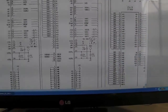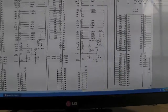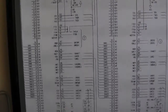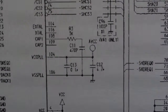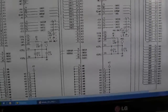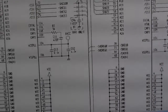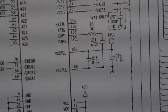Anyway, I'll just run through a few other things I want to talk about with regards to SDRAM. I also want to do a quick test on my other 32X just to see what's going on with the reset - is that known behaviour? Just look at the two SH processors side by side. I started thinking the pin-outs must be the same and each must have its own PLL type clock control circuitry - and indeed it does. You can see C11 is the 470 pF one on the first processor, whereas C14 is the one that was missing on the second SH2 processor.